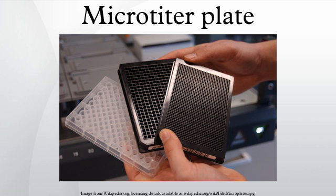A number of companies have developed robots to specifically handle microplates. These robots may be liquid handlers which aspirate or dispense liquid samples from and to these plates, or plate movers which transport them between instruments, plate stackers which store microplates during these processes, plate hotels for longer-term storage, plate washers for processing plates, plate thermal sealers for applying heat seals, de-sealers for removing heat seal materials, or microplate incubators to ensure constant temperature during testing.